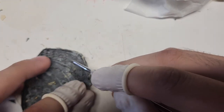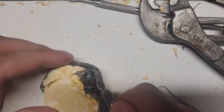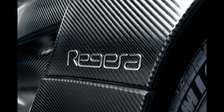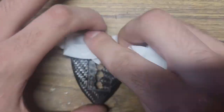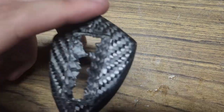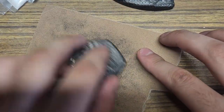It took a lot of work to break away the gypsum, and the surface was slightly rough — but this was just the wood glue stuck to the piece, so I soaked it in a bit of vinegar and water and was able to rub the softened glue away. One thing I quickly realized was the slight difference in overall length between the two pieces — this was my fault as I excessively scraped away the corner of the mold while attempting to smooth it out. I wanted to try to replicate the naked carbon look from Koenigsegg where the epoxy on top of the carbon is sanded down until you reach the bare strands, resulting in a chrome shine. I used some solvent to remove what I could from the top layer of epoxy. For one piece, it was not properly cured due to the thickness of the gypsum not allowing the heat to reach the center, so I ended up stripping away almost all of the epoxy in the top layer. This gave a really nice look but caused some of the strands to start peeling, so I decided to re-cure it and then mix up some resin to put a top coat on both pieces.